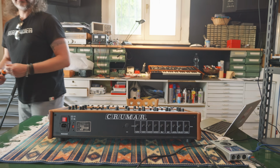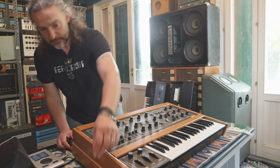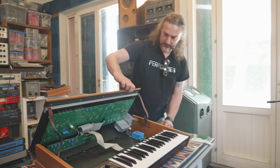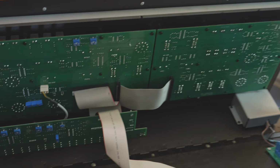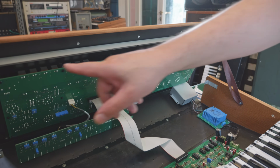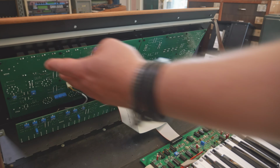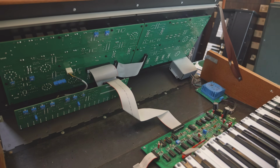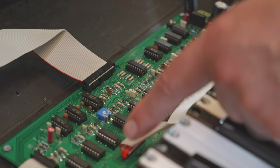And now we voided the warranty. 4 screws. Yes, 4 screws. That's easy. Yes. Compared with other synthesizers where it's like 12 screws. Oh, it looks very clean. We also changed a little bit to make it more serviceable. All the trimmers are here, so you can reach them easily. In the original instrument, there were a few here, a few on this side, a few you have to open this, remove from this, all THT. So there are no SMD. All the integrated circuits are with sockets.